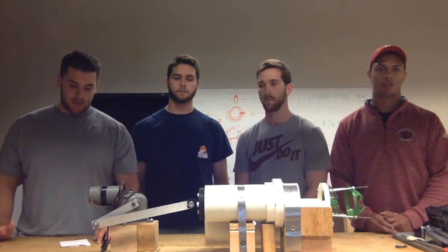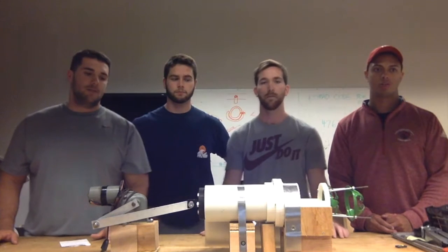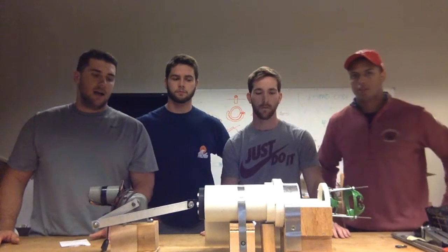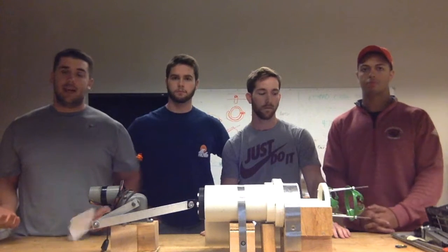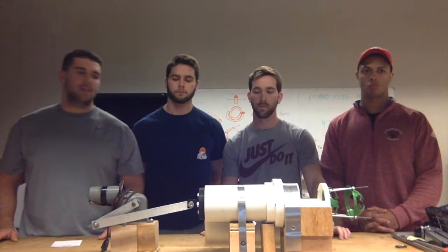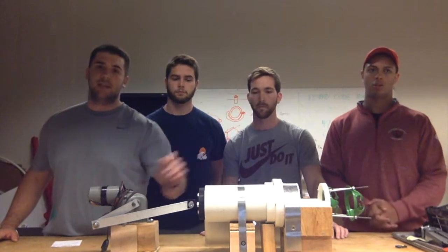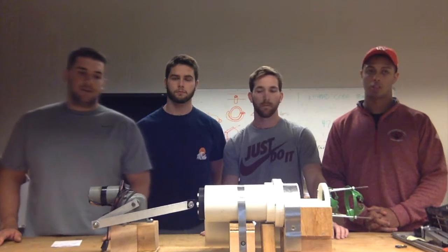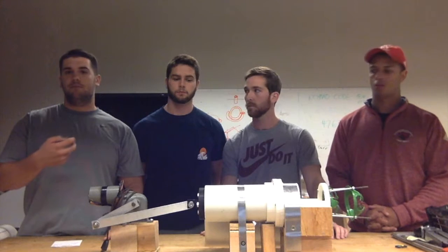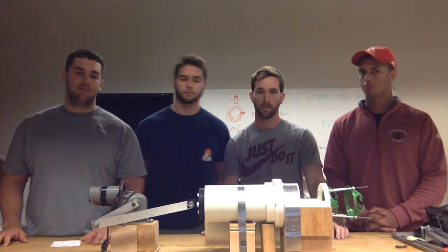So we started designing a product, and this is what we came up with. Our initial prototype was always based on this idea of a cylinder pushing the onion through some knives and cutters to make it peel. Initially we had some different ideas that had to be adjusted — we wanted to use a metal cylinder, but for friction purposes we had to avoid that. We also had to add some extra supports to hold it down from the force pushed through it. Our original design included a smaller motor, but we went with this one after conducting experiments where we used a fish scale to pull onions through the knives and peelers, which allowed us to find a properly sized motor.